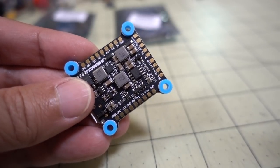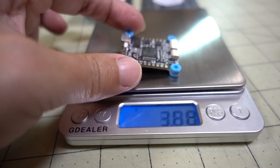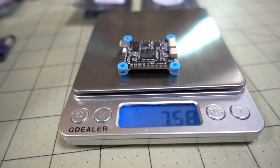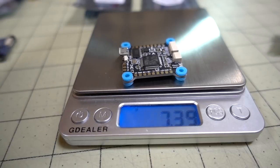Hey, Albert from the future here — just a note that the dual camera feature and the 8-volt output are both switchable via an aux channel using the User1/User2 feature in Betaflight. The 8 volts is off by default, so set the full range of an aux channel to on, or assign it to a switch to keep it on all the time. You can also switch between C1 and C2 for camera switching via aux channel as shown in the diagram. The Deluxe version weighs 7.58 grams and the Acro version is slightly lighter at 7.39 grams.